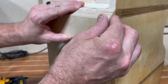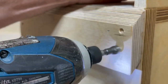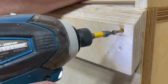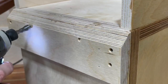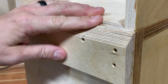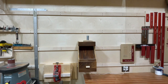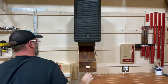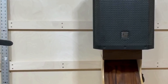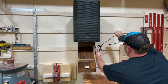Now for the cleat — I'm not using glue, just mechanical fasteners, which I think is the strongest method. Take two screws about an inch apart all the way to the right and left, penetrating through the backing material and the side of the cabinet. At the top, angle them slightly upward into the top of the cabinet for maximum strength. The speaker is about 50 pounds with a lot of forward weight, and this will be plenty strong. On the wall I also have doubled-up screws every 12 inches in the cleats, through three-quarter-inch plywood into the studs. Cable management done — here's the reveal.